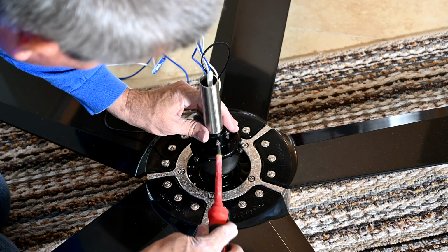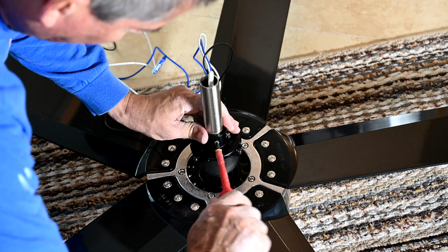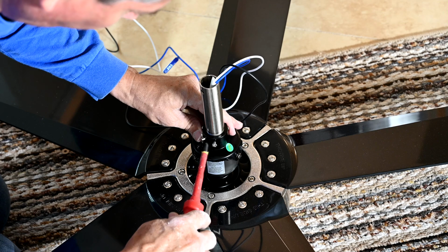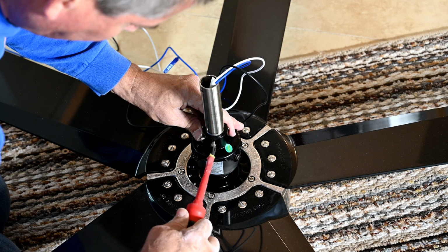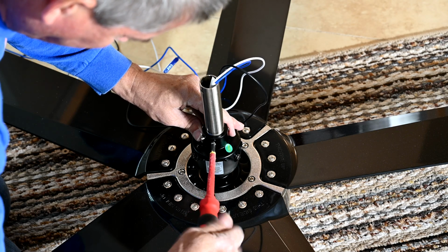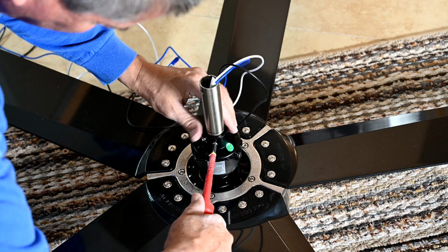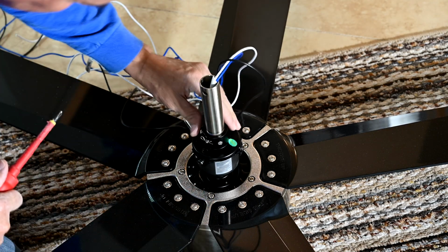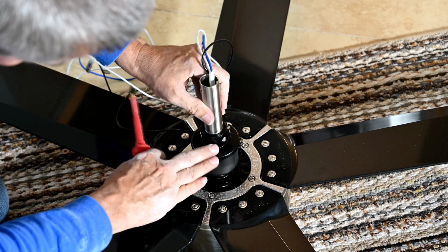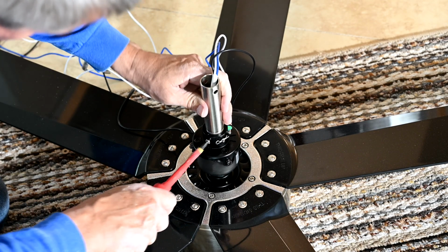Okay, now that that's back in place, you need to retighten any set screws here that you'll typically find here. That's what helps really keep this thing locked into position there. You don't want any wobbling later on. So this is one of the causes of wobbling, is when people don't tighten these set pins down. Because once this rod here is threaded in, these two should be as one, like love and marriage, husband and wife. They should be rock solid. When one moves, the other moves. Where you go, I go. So these have to be really good and tightened. Make sure they're not going anywhere.